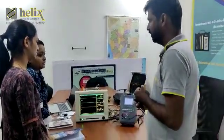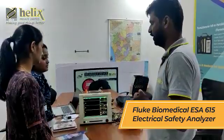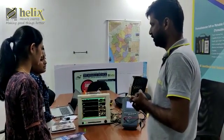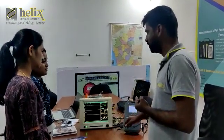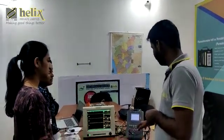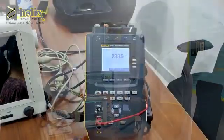The first is the voltage test — we are checking the input voltage quality. The second one is the current test — we are checking the load current of the device. The third test covers three types of leakages: one is earth leakage, enclosure leakage, and patient leakage. The fourth option is earth resistance — we can check how much resistance is there. And the final option is insulation resistance — we can check the insulation quality of the power cord on the device.